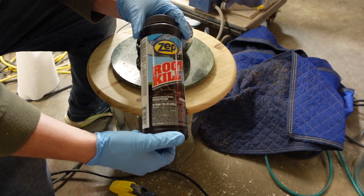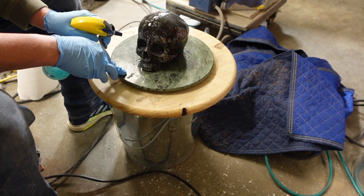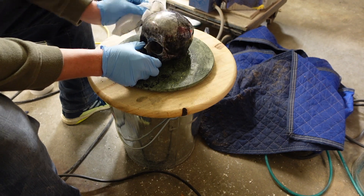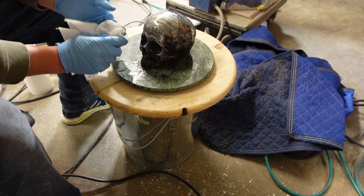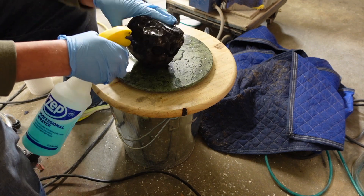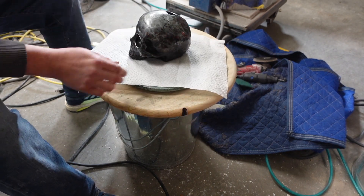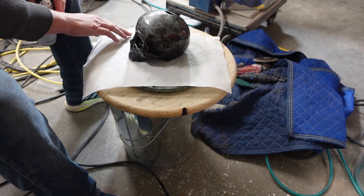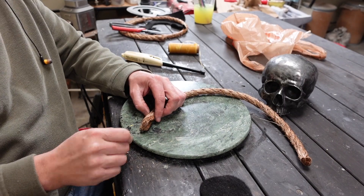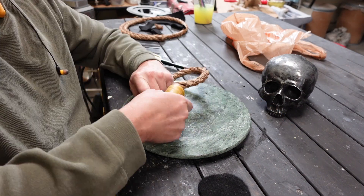I like my pieces with a little bit more antiquing. I use this chemical here and it's an acid base. This is actually how I test to see if something is a zinc based metal — you put a teaspoon of this chemical in a spray bottle and mix it up really well. It will oxidize the exterior into that black color. Then I actually polish it back a little bit, and you do want to wash off the acid after you spray it on — rinse it in water before you buff it back and put a clear coat on.